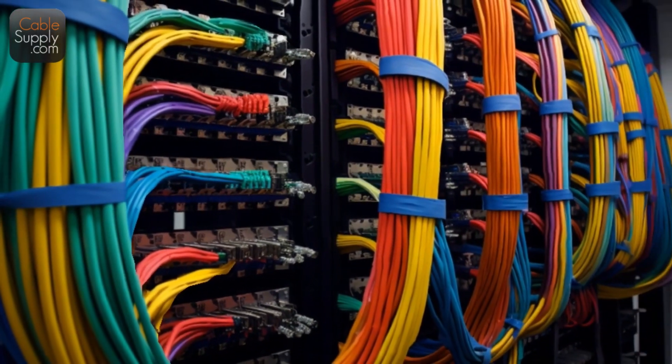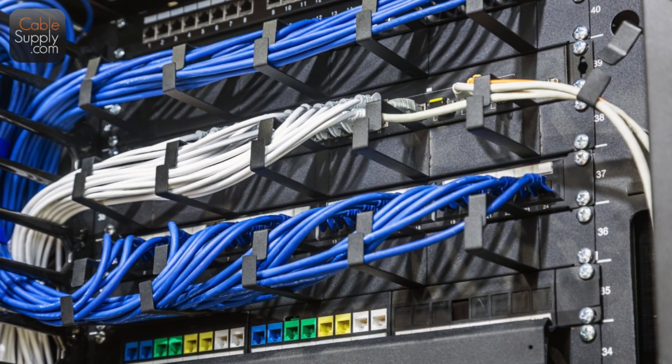I do use a printer, but in a different way. I use Brother printers — I'm not blasting them, they're just trying to sell their product differently these days. I cable everything, then take the cables and terminate them. When I'm terminating them, you see how the cables come down the wall, bend nice, come into the back of the patch panel and look fantastic — with Velcro tie wraps at every foot or so. I punch down everything on that patch panel, and all the jacks are punched down. But I haven't labeled anything — no Sharpie, no serial number system. It's not necessary; it's a waste of time.